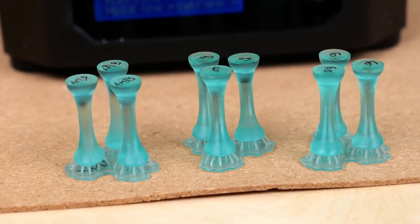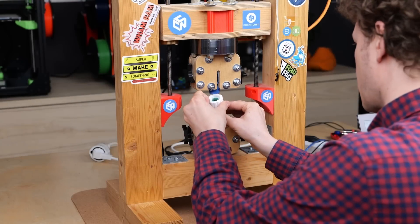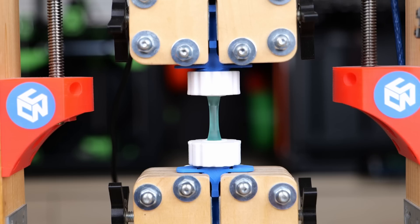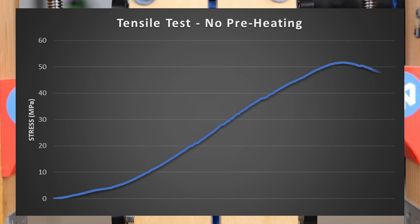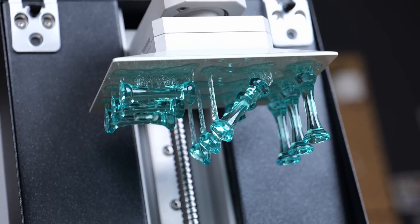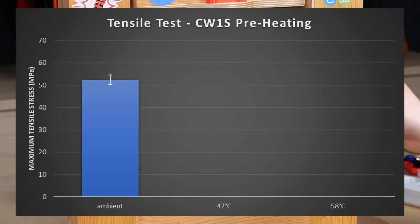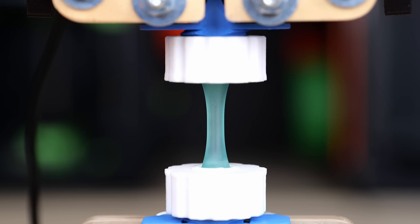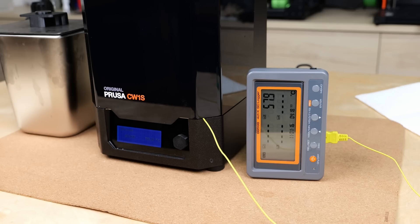I was still curious if we could already see an effect, so I went on to test these samples on my DIY universal test machine. The samples printed without any preheating showed a very impressive strength of 52 MPa on average with a lot of yielding before failure — well in the range of what I usually measure for PETG prints. The samples preheated to 42°C were slightly stronger on average at 54 MPa but with a bit of scatter. The samples heated up to 54°C were the strongest with 10% more load required to break them. We can already see a trend in the right direction, yet I honestly expected a bit more, wondering if that was due to the heat not being properly maintained.